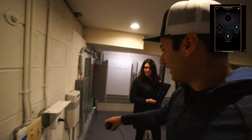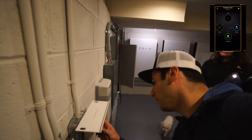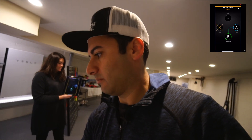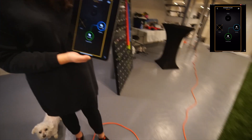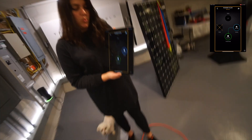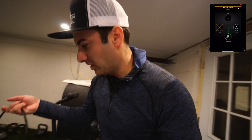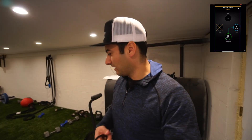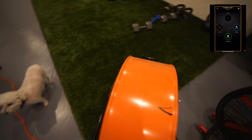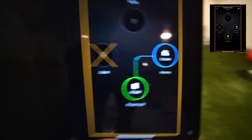Next are these lights that light up the Powerwalls — let's plug those in. The next thing is this little mini air conditioner slash heater that always uses a ton of power. We're still at 0.7 after those lights. Let's plug that thing in. You'll see in a second that should bring the draw up. It went from 0.7 to 0.9. Next thing we're about to turn on is this industrial fan.